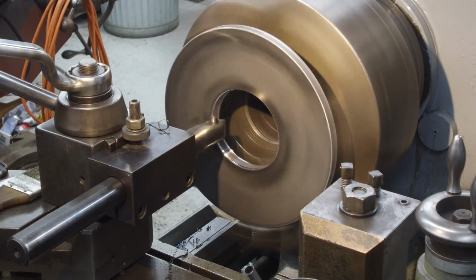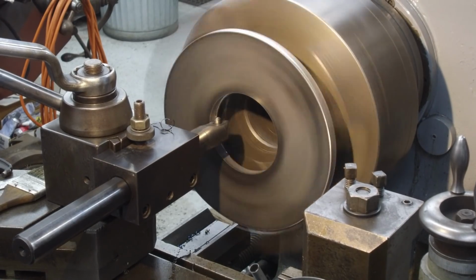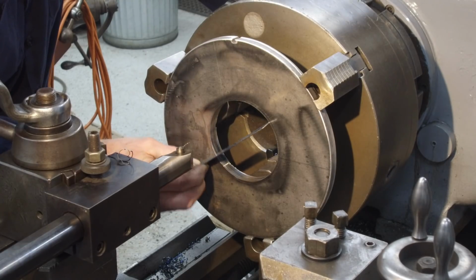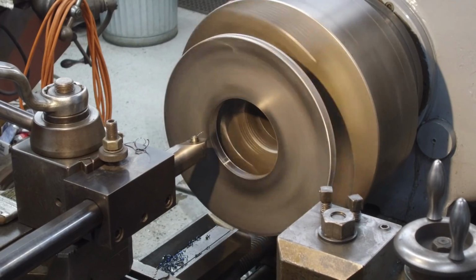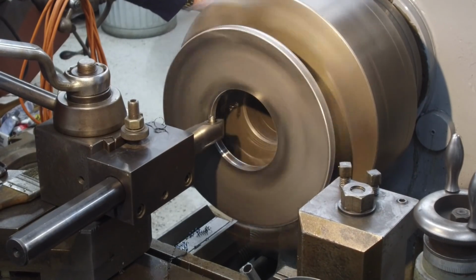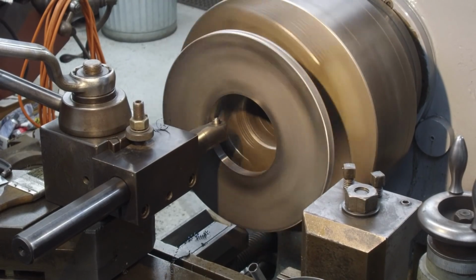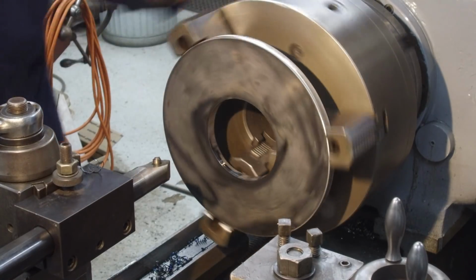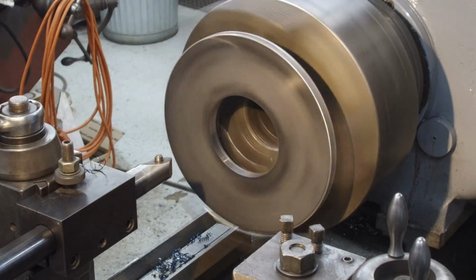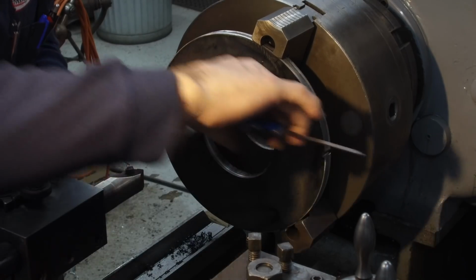There we go. Okay, we're still under 4. Take another 25 or so per side. Good round hole. All we need. Okay, looks like a little bit more right there. And we're at 4 inches, 36 thousandths. Okay, 227. So we only got about 23 more to go.